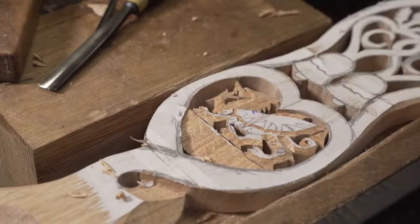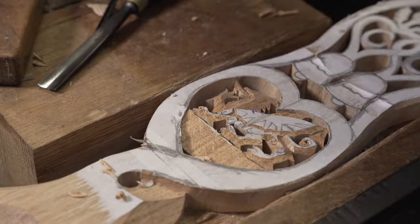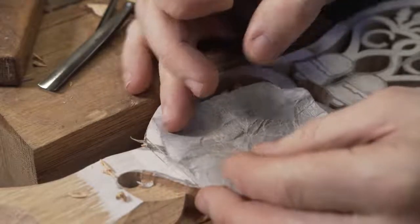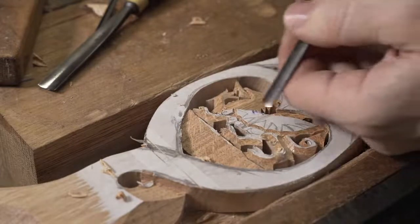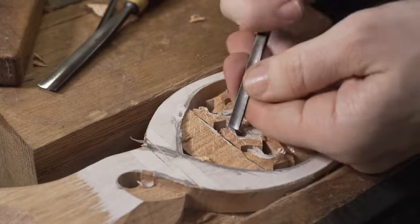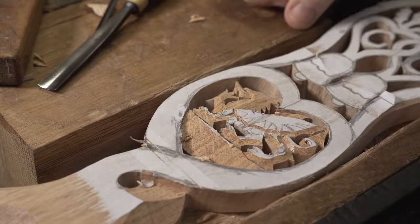The only ones that we buy, there we are, that's what I've got left over of old stuff. The only stuff that I buy is this one here, and that is for the actual finishing. So when we're shellacking, rubbing it down in between each coat, we use a little bit of that to take off the little bit of roughness from the shellac finish.